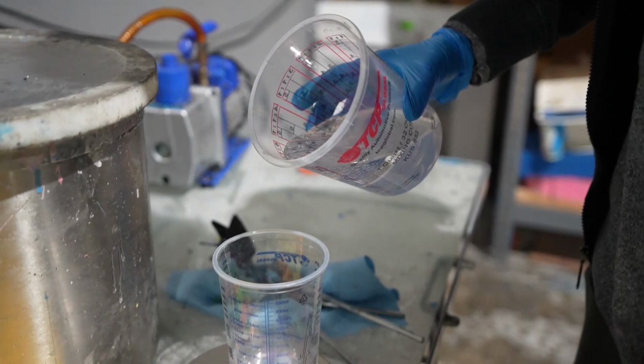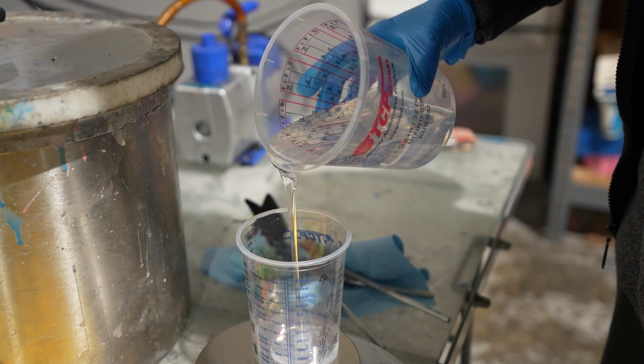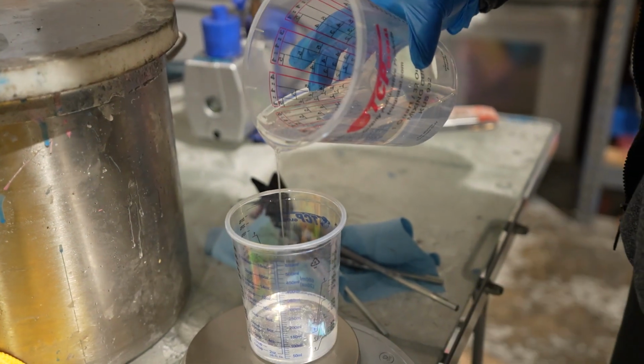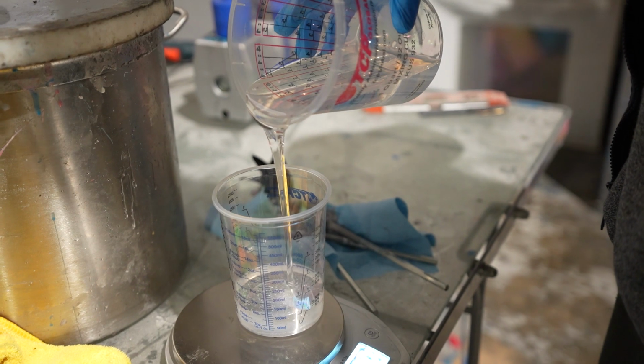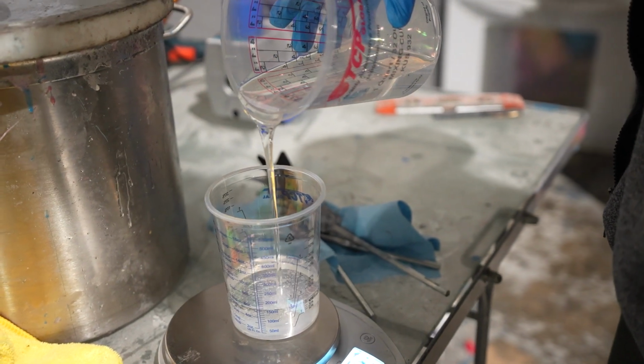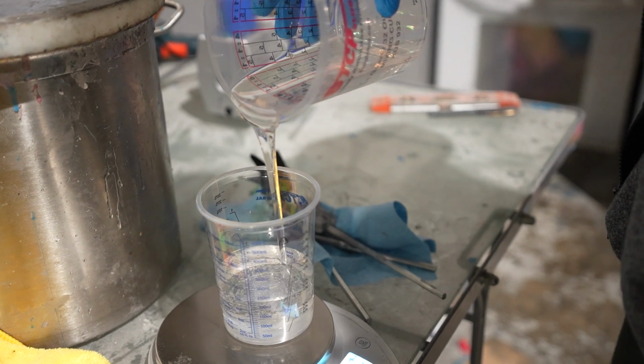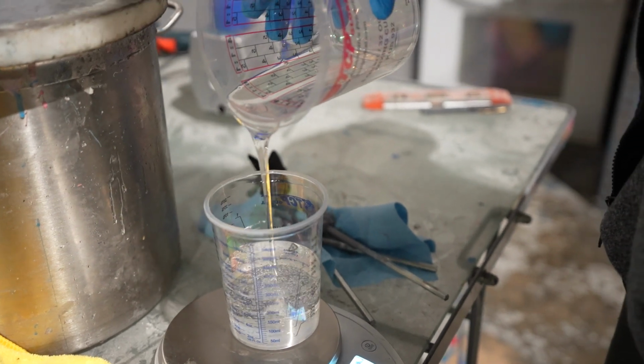Second step is you're gonna wanna get your mixing cups ready and the clear resin you're gonna use. We're gonna be using Crystal Clear 202 Part A and Part B. I believe it's a 9-to-1 mixture. So pour Part A and Part B to whatever measurements you guys got, and we're gonna be using whatever measurements we have for today's lenses, which is the Supra Mark V.